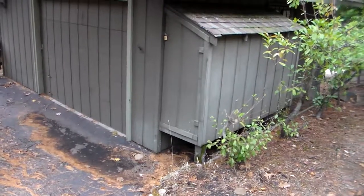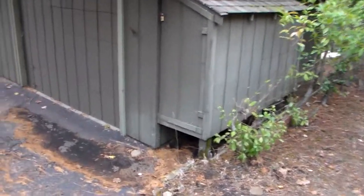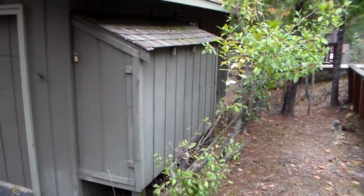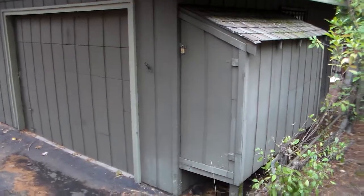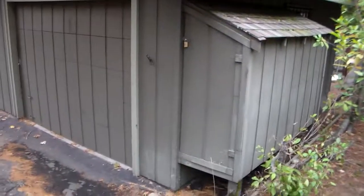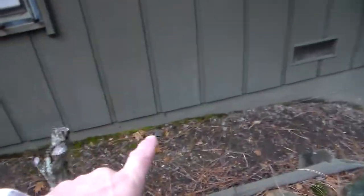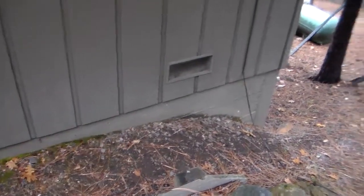It's basically the same as walking it together. I'll go through a brief overview of what we do. Obviously, the first thing we do when we get here is all lights, knickknacks, and everything is stripped off the building. Then all areas of dirt around the concrete — the stem wall — are trenched. We actually dig down and pull back the dirt so that when we paint the new color, there's none of the old color there. Then when we're done, we push the dirt back.